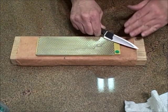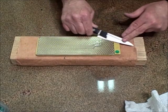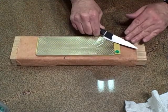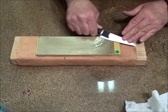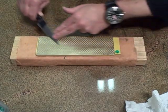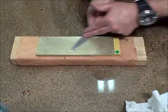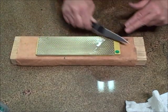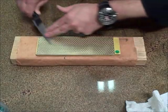This is an asymmetric grind. This 1200 mesh, 1200 grit diamond will put the first layer of mirror finish on this blade. You just have to learn to feel the angle of the knife — the angle of the grind that you've put on to polish — and it takes a little practice. This is where I start to baby my blades and I don't use that reverse Japanese grinding stroke anymore. Doing it this way is a little easier and saves a little bit on steel. You'll just learn to feel the sweet spot as far as the angle is concerned.